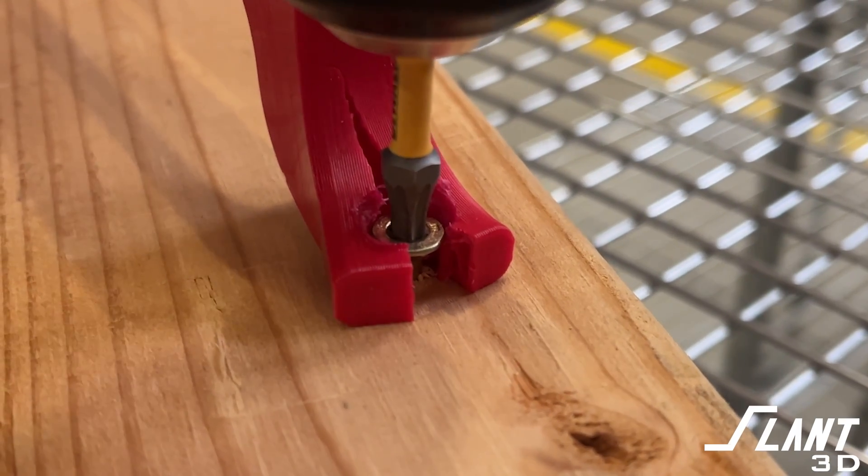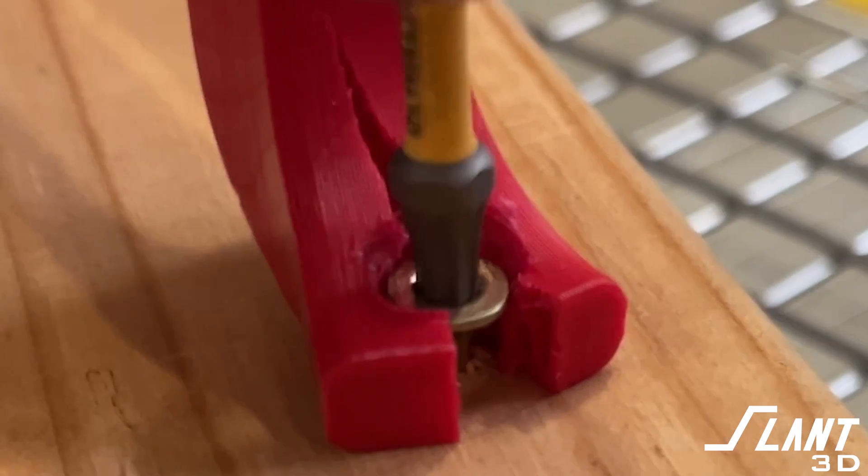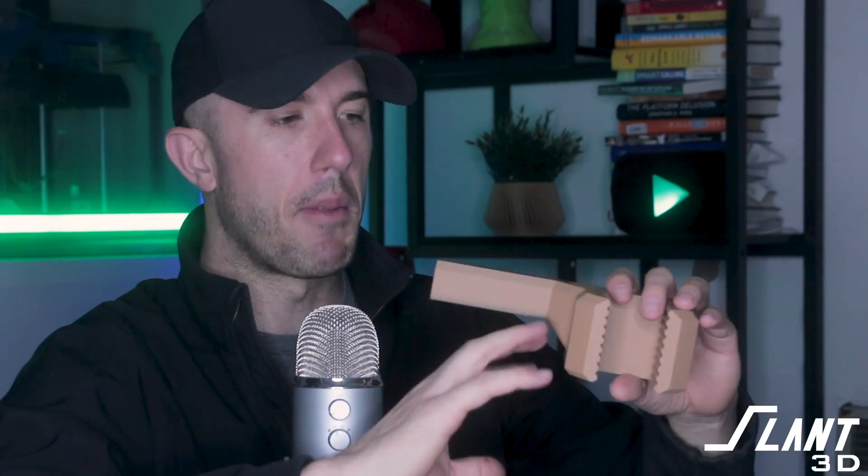Overall, we have texture around the outside which gives better grip on the interior. If redoing this part, we'd probably use a slightly tackier material like ASA or even nylon to make sure it's really durable and tough — though this piece would be able to hold up a person. When you look at the strength of a part, all stress appears in the outer skin. When pulling up on this handle, it would start to break on the outside and the crack would propagate through. But since there is so much outer surface — because you're able to make these really thick parts — that stress is spread out over a much wider area than with a molded piece that has ribs and a thin skin that fails catastrophically.